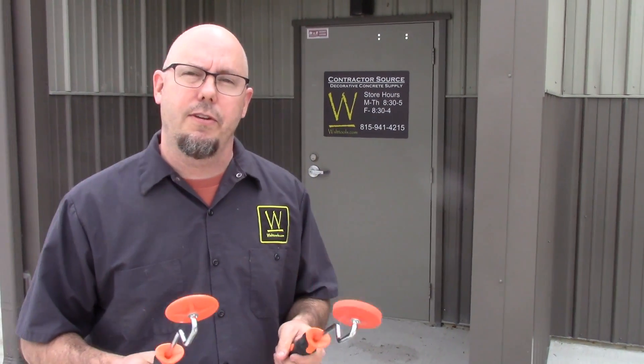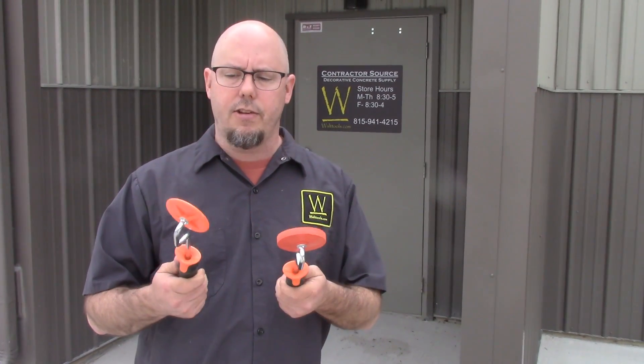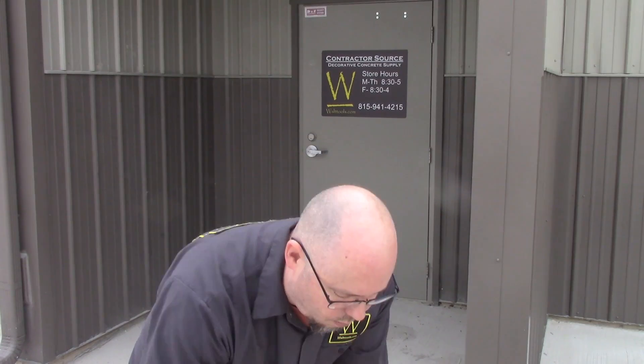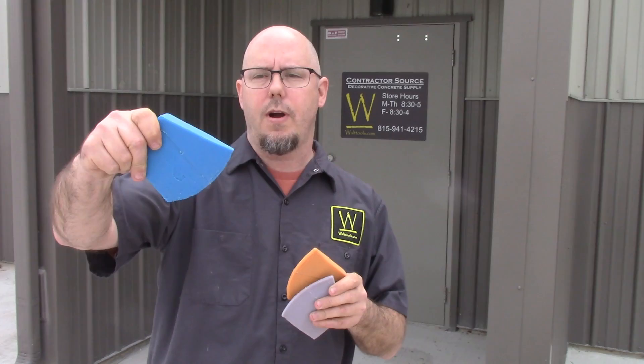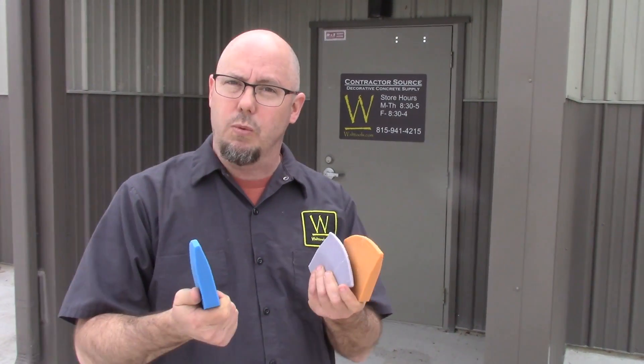Some common accessories for concrete stamping that you're going to want to have on hand: grout rollers are very handy — they come in different size grout lines, some are sanded, some are plain, and they're great for touch-ups. Just keep them in your back pocket as you go along. They're great out in the middle, but when it comes up to an edge or a wall, you're going to want to look at the Walt Tools grout tool set — a quarter inch, three-eighths, and half inch. These are handy when you go up against a wall; it's a rocker profile so they can back right up into a wall and get a great impression where a roller won't.